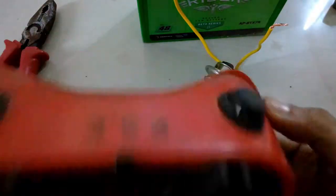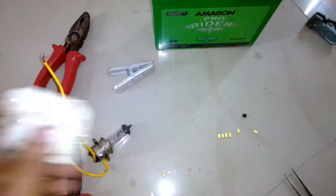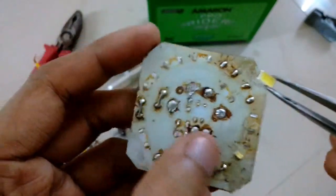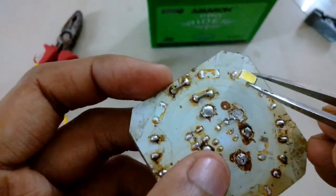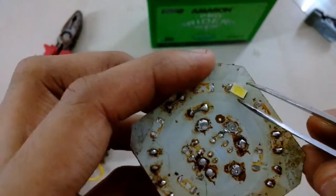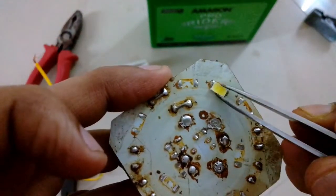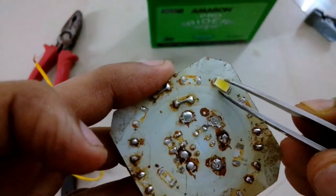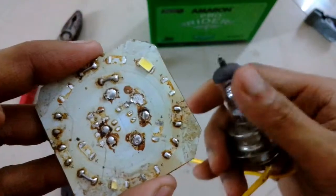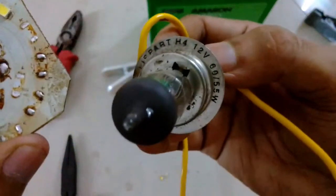This is the welding goggle I was using. The solder melts really slowly, so you need to wait a couple of seconds and use the tweezer to try to move the components slightly. If it's melted, you'll see it moving and you can easily pick it up. But if you do it in a hurry and try to grab and pull it, it might break — that's why one of the SMD LEDs was damaged.